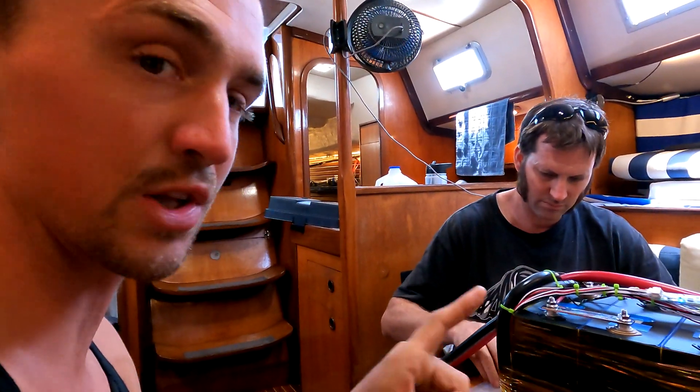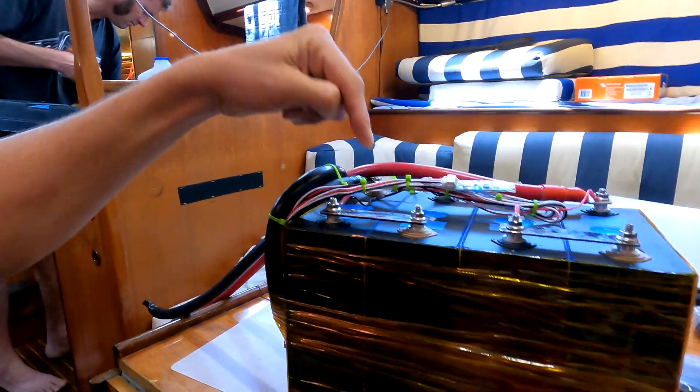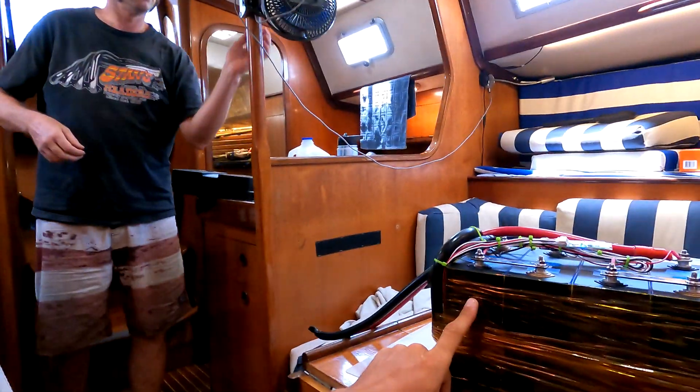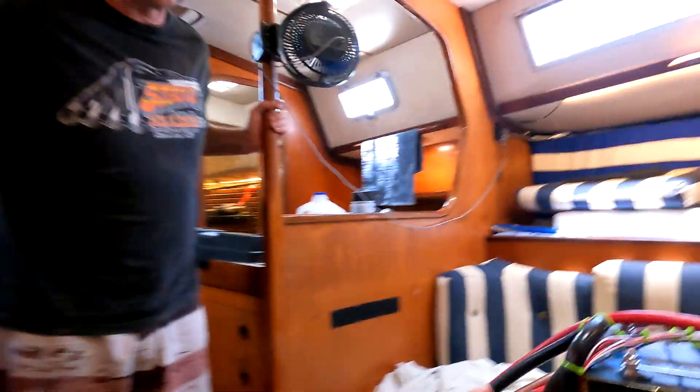Lithium requires a little bit more stuff. This is a BMS — battery management system. It is a very special, very complicated chip that has its own lead going to a different positive, with one more going to a master negative to give it electricity. There's effectively a lead on each one of these that tells us the voltage, and it also measures how much current is going in and out — it has its own coulombic counter, but the accuracy is kind of iffy. That's why you want the Victron one — it just works better. The BMS will also manage the battery because it's easy to mess this battery up: too much current in, not enough, discharging it too much, temperature high or low — there are a lot of things.